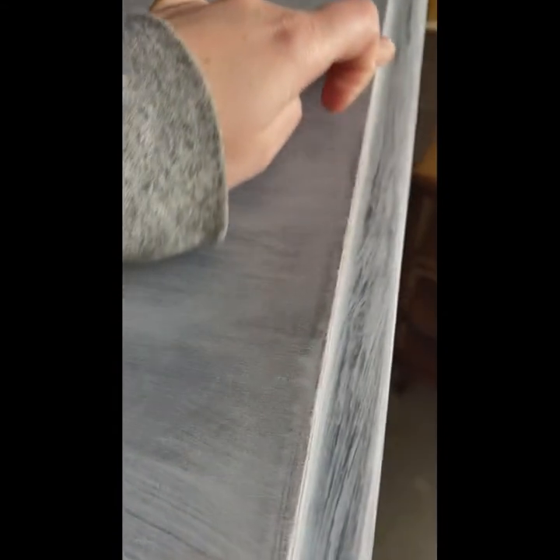After the first coat I take some time in natural light to see if there are any gouges in the wood that need to be filled with wood filler — once you get a coat of paint on it, it's sometimes easier to notice those spots. You can see here there are a couple of surface ones that would get filled in by the next coat, but there were a couple of slight spots that I did end up filling and sanding down after they dried.